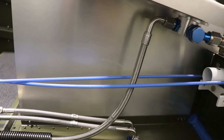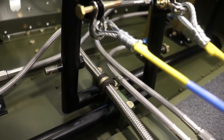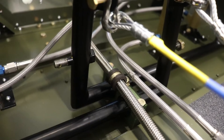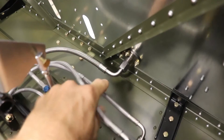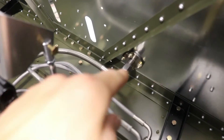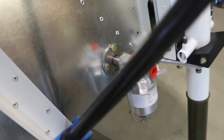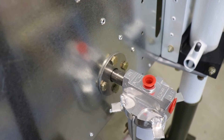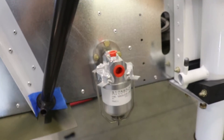Since we're up front here, I can show you I have this line installed. It goes from the fuel selector over down here, there is a clamp holding it nicely in place, and from there it goes forward to the firewall. From this side here you can see where it goes to — there's the fuel line, and it goes up to the firewall. This fitting right here is kind of like a bulkhead fitting for the gascolator. I ordered this from Aircraft Spruce, and here is the part number for this piece if you want to use the same thing. It works pretty nicely — I have the same thing in my cruiser, and it works nicely for the Super Duty too.